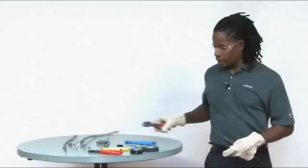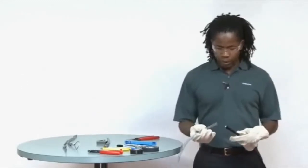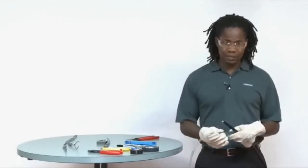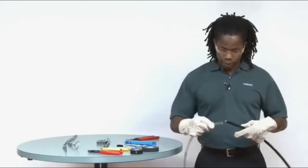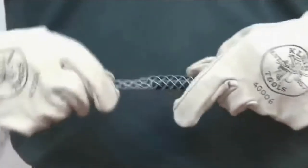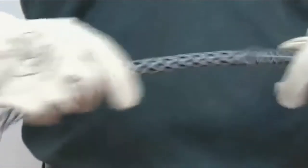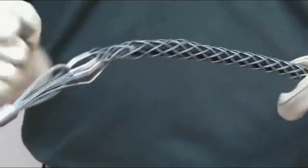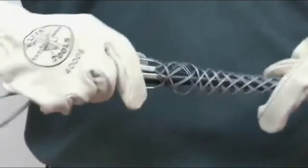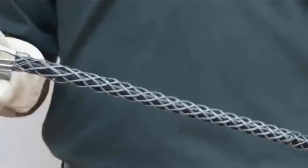Locate the cable end. It's now time to install the pulling grip itself. Rule of thumb is the pulling grip that fits over the cable without excessive difficulty is the right pulling grip. So we'll just insert the cable on the end and we will use a pumping action to get the pulling grip onto the cable. We're going to stop about a quarter of an inch from the basket — that looks about right there.